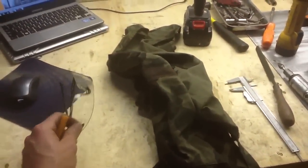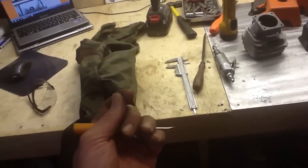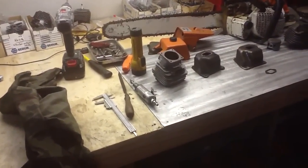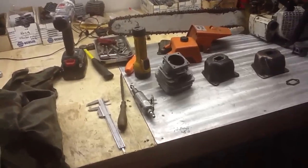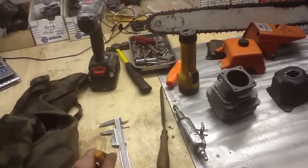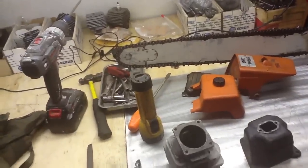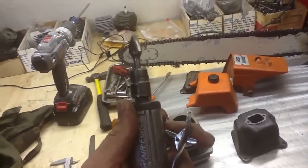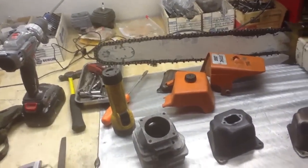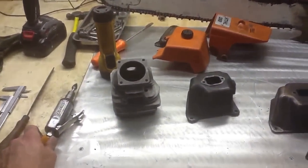Some of the things you're going to need: a pair of safety goggles, coveralls or an apron. These aluminum shavings get everywhere — they kind of meld into your hands and onto your clothes, and they get on other clothes when you wash them. A caliper is a good idea to take initial measurements and track your progress, especially if you have your target numbers figured out. Files are useful — you can always file it the old-fashioned way, and they're good even if you have air tools to slow down and check things. An air cutter with a cutter bit is great — there are a multitude of different bits available. A flashlight is good, along with various hand tools and power tools. You can also use an electric Dremel with all the bits they come with.